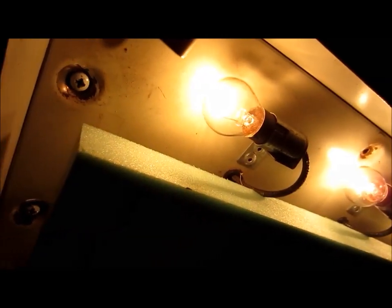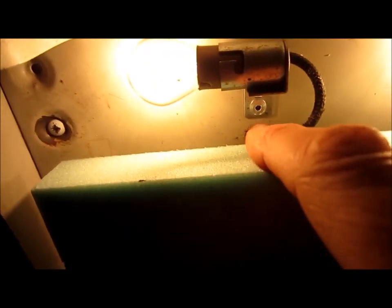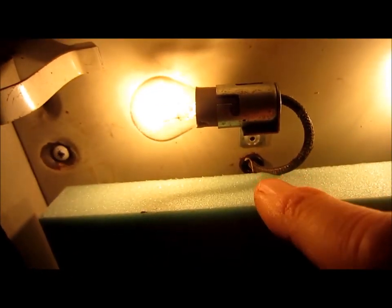I decided to make this piece wider and a little bit longer so that I'll be able to have pure metal to screw into instead of that screen, which wouldn't be very good. But in order to do that, I'll have to cut notches out right here to get that to fit up snug. I already cut a notch out there for the lifting mechanism for the fan cover. Now I made the marks with a pen, and I'm going to cut that out.